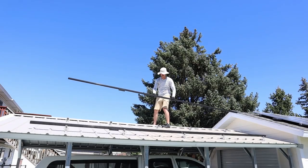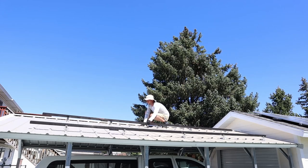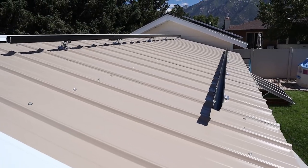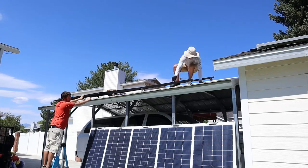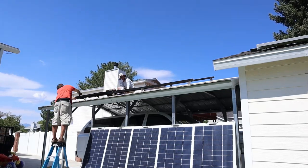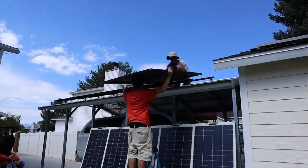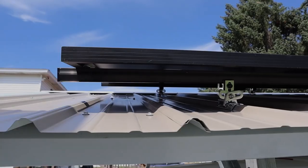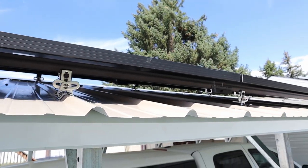The next step was installing the solar rails on the mounting brackets. Once I cut each rail to length, I took them up on the carport and snapped them into place, then tightened them down. Here's what both rails looked like once completely installed. With the rails in place, I had my brother help me lift the panels up onto the rails to mount them — this was the only part of the project where I needed an extra set of hands, and I'd definitely recommend having someone help with this part. Here are some close-up shots of the mounting brackets, solar rails, and panels all mounted together. This was my favorite part since it went so smoothly and I really liked the final results.